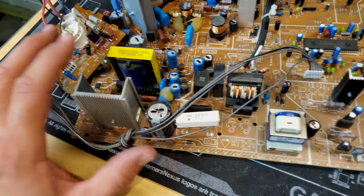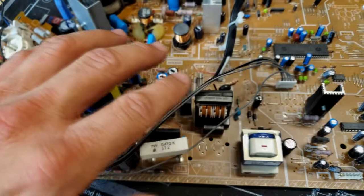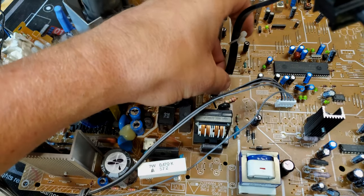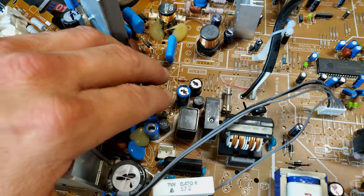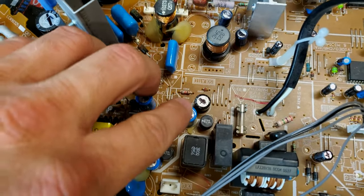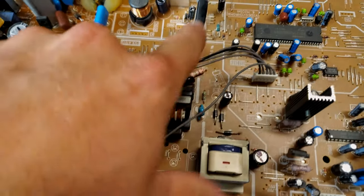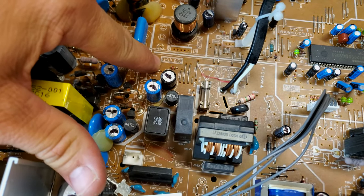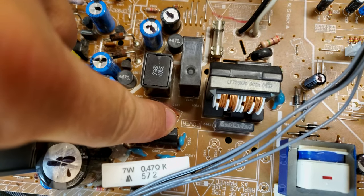Now over in this area is our power supply and all the voltages that will come in from right here. This is our main plug that's soldered into place from our wall. So the wall voltage comes in here and then it gets transformed into the different usable voltages. So we've definitely got these capacitors within this block. And you see how it's marked by these lines. This is our isolated power area. See how it says isolated? And then right where my finger is, it says power.